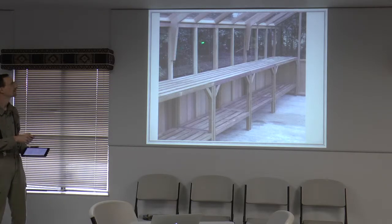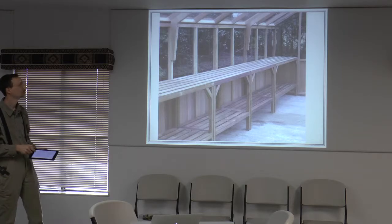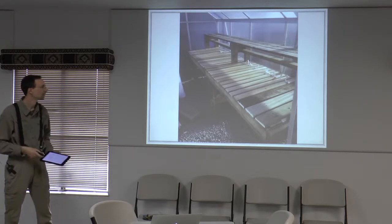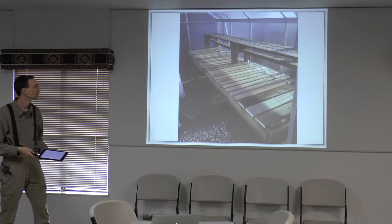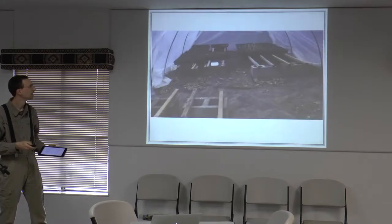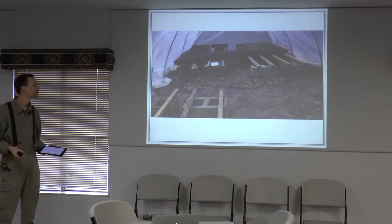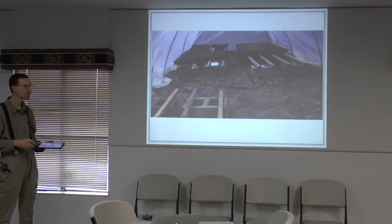Some pictures here — glass panes throughout, probably made out of cedar, a fairly nice one. Here's a very simple shelving option using pallets taken apart, with two-by-sixes for the frame and simple wood on the bottom. You don't actually have to have it completely filled in. On mine I just have some two-by-twos — I started out with two-by-fours and two-by-sixes, whatever scrap wood I had, and then switched to two-by-twos because they're a lot lighter to carry around when setting it up.